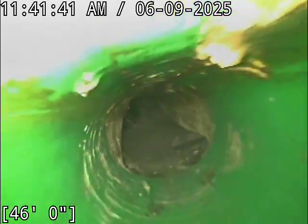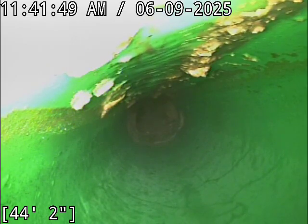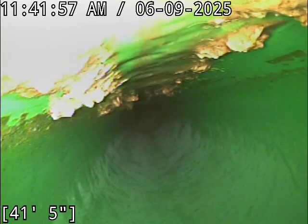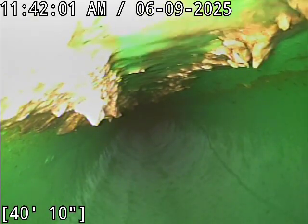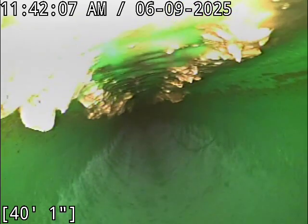And we're just about done draining out. Just a tiny trickle going through the pipe here. So the one thing I will clue you into, and I'm not trying to beat you up here, it's something I talk about a lot on my videos. As long as I've been doing this, grease buildup has become one of the most concerning things I've seen over time. In fact, it's honestly more concerning to me than a lot of structural issues like bellies and offset joints. It's often a culmination of a structural problem combined with stuff like grease buildup.